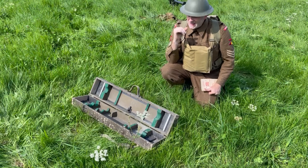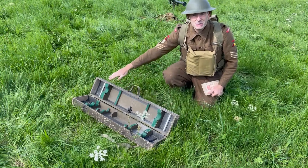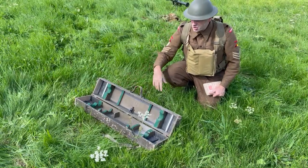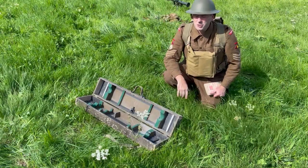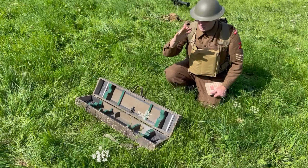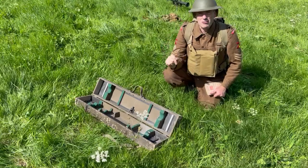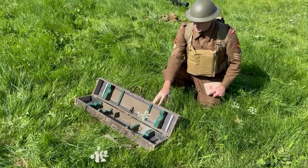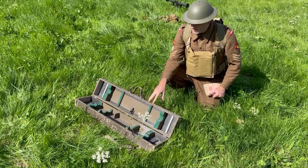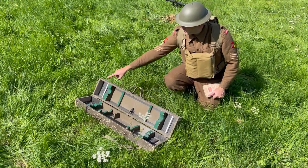Then you take your instrument and take measurements right up to infinity and do the adjustments, as you would do an adjustment on a known range. You measure to that, then go left — using those three lines around infinity to take those adjustments and make the calculations that you need to. So this is the artificial infinity that you will use — that's the function of these two white lines.